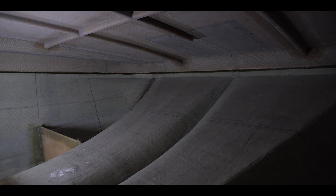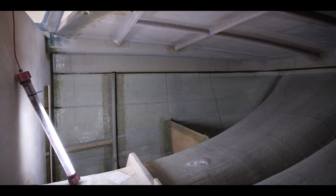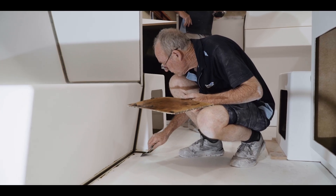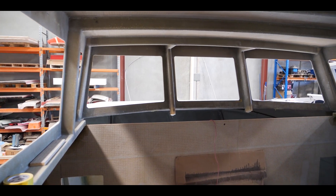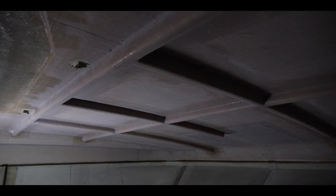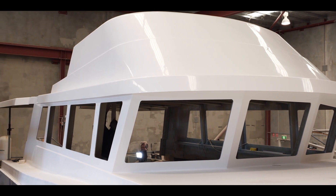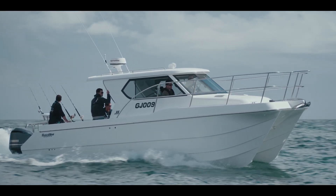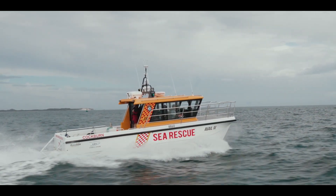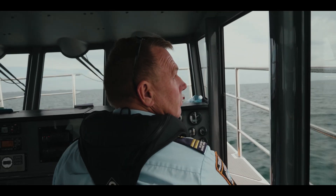We've infused a whole bunch of components to build the boat and at some point they all need to come together. Traditionally boats were held together with bog — which is brittle — and maybe bog and tape, but all of these things lead to floors, frames, or bulkheads coming away. Crestomer has an adhesive product we use here in-house — we glue the roof to the wheelhouse, the wheelhouse to the hull, frames into the hull, and the floors in. We also infuse and tape some components. The Crestomer adhesive offers up to 300% elongation before failure, and in our extensive testing we've always seen failure of the substrate, never the adhesive.